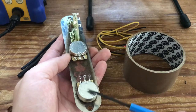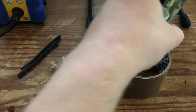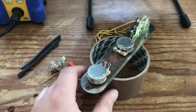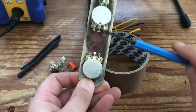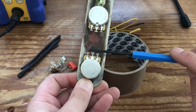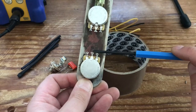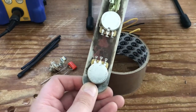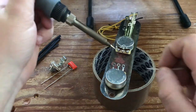On a classic three-way this would be the volume and the tone, but of course it's a reverse setup. So this is now going to be our volume control and this is going to be our tone control, with the capacitor. If you've watched enough of our videos you know we like to start with a bit of tinning and grounding. On your volume control you need to always ground this terminal here — it's the most outer one, the left-hand one.